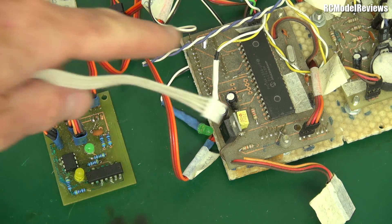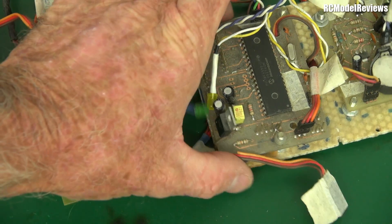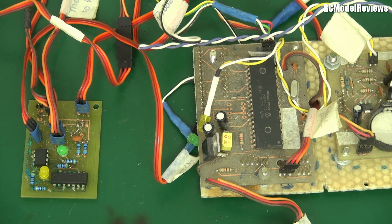This autopilot had no gyros and no accelerometers — this was way before cheap smartphone components were available. If I'd wanted to add accelerometers and gyros it would have cost many thousands of dollars, and getting decent components at the turn of the century was rather difficult because it was all classified military stuff. So I used another model component available in the model flying community.